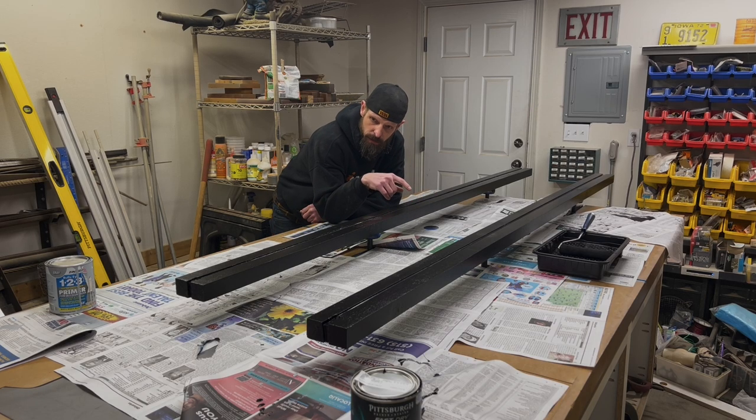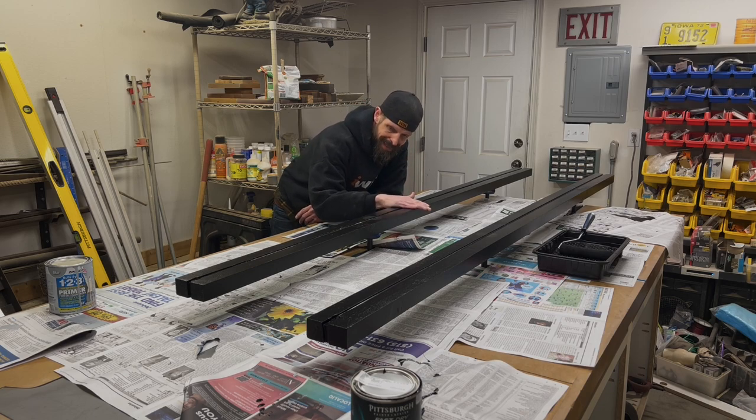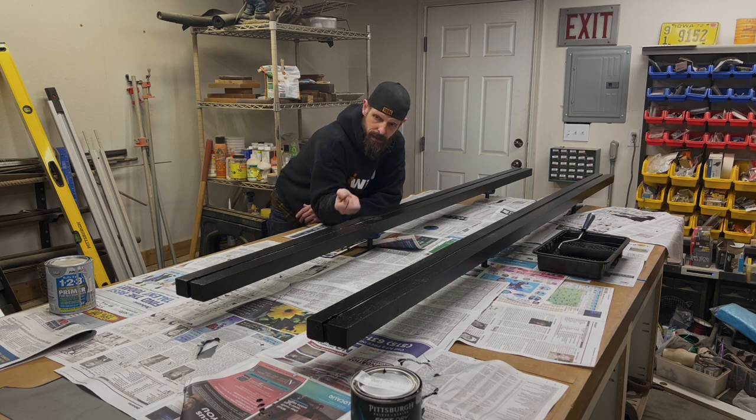Before we go into setting the lights down, you're gonna see that I'm not going to put any adhesive on here. So I suppose you could throw some silicone on it to hold it down. Although just remember that this is getting a cover on the top and then end caps. So it's gonna be completely sealed inside the enclosure. It's not like the LEDs are gonna come out and they're waterproof. So that's not gonna make a difference.